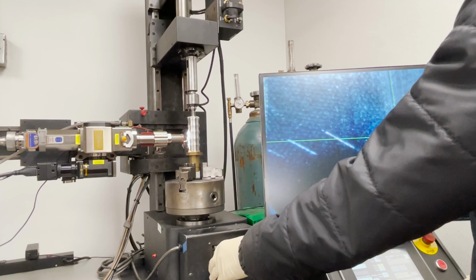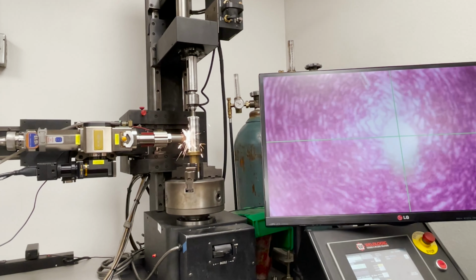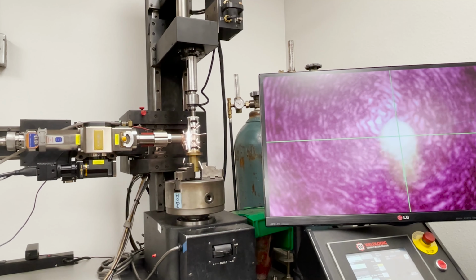So yeah, what is it? It's essentially a whole bunch of individually machined pieces which are then fitted together and laser welded into one single assembly, the same way you make a tubeless silencer. The reason we did this is it gives me total freedom on the inside to create whatever internal geometry I want.